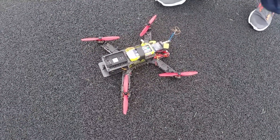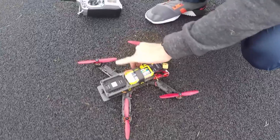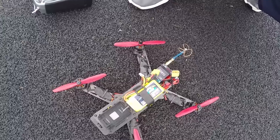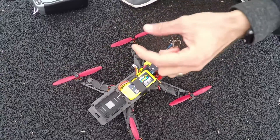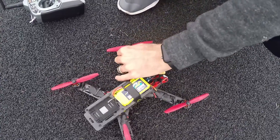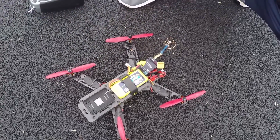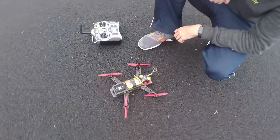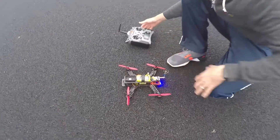Jason, you said you did end up having one wire crossed on an ESC when you tested it? Yeah, this guy over here burnt up so I had to replace it. Basically it sounded like the solder got a little out of control and shorted. I think what happened - even if you use heat shrink, sometimes the solder can get sharp, and when I wrapped it and zip tied it, I think it punctured through the tape and wound up shorting out. As soon as I turned it on it immediately started glowing and smoking - so that's bad. Had to replace it, but good thing we tested it before this. Now we're gonna actually see this guy fly.